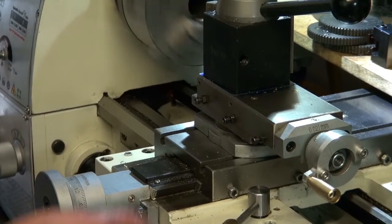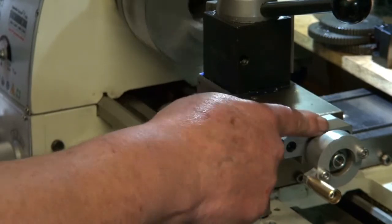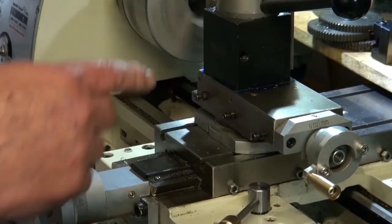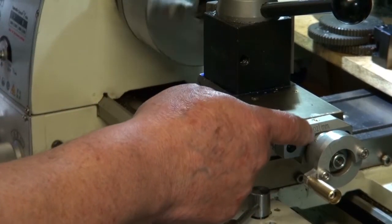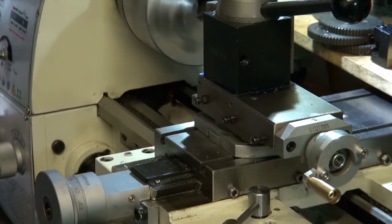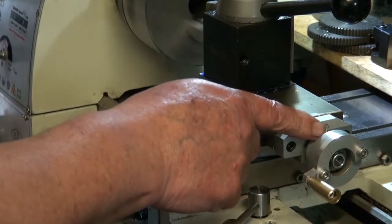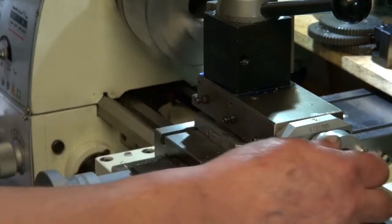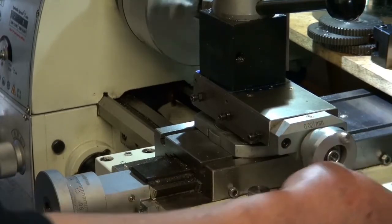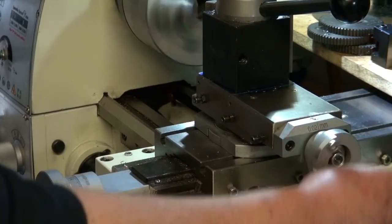The other thing I did was I wanted a thrust bearing behind here, because it was just metal to metal, and that made it notchy going in one direction. So I bought a thrust bearing, and this one has got rollers in it, and it's only 2mm wide. So you just put it straight on, it goes behind the key in the shaft. There's just enough room to pop it on. You can machine the back of this out to cover it up, but it's only 2mm, and that has made it exceptionally smooth. You can wind that very smoothly. So that's yet another job you have done.